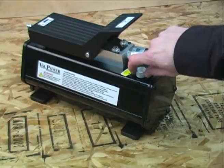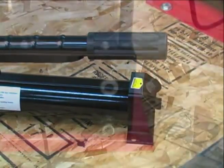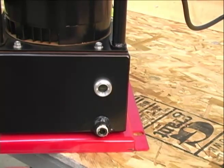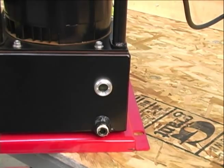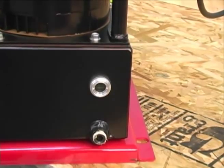Be sure to open the vent plug on the pump to allow proper operation. The D105 and D165 crimping machines come with a 10,000 PSI pump that is already connected to the crimping head at the factory.